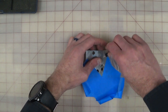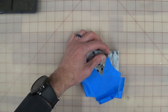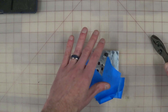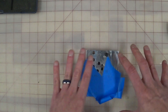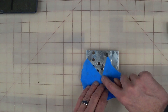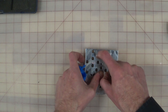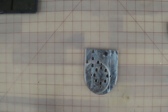So I'm going to bring this so it's just reasonably tight. I'm going to come back later as we get further into the assembly and add Loctite blue on all these to make them nice and resistant to vibrating loose. But at this stage I'm not Loctiting anything — I just want to make sure I've got it all together and I'll take it apart and goop it later. Now we can see this is tangent to the center of the bolt circle — that's our center point — so that when a thing swings around and hits that, I think it's a limit switch probably, and it hits it on the flat sides.